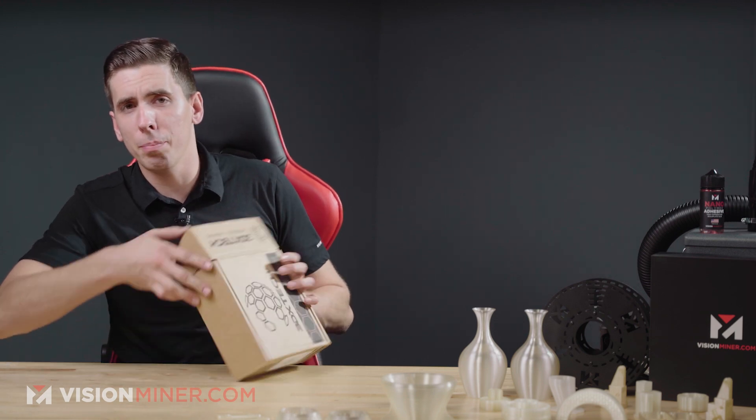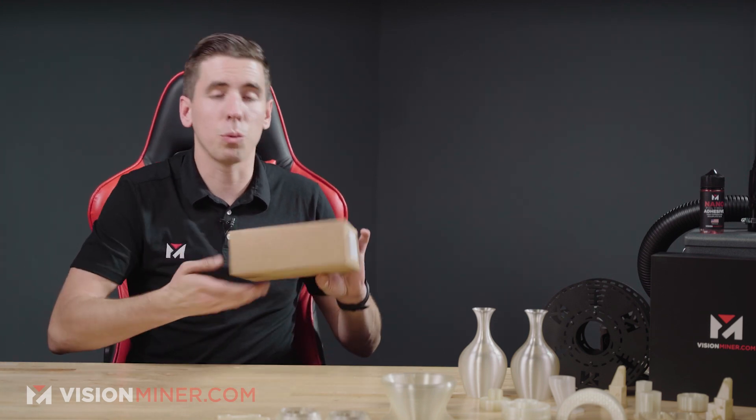Let's talk about where you're going to see this material in actual industries. Firstly, you'll see it in a lot of medical instrument components — manifolds, medical trays, autoclavable instruments. Other industries use it for connectors and coil bodies, high-frequency insulators, lamp sockets, protection caps, and antenna sockets. In automotive, you'll see it used with oil level indicators, valve spools, flanges, tubes, pump cases, and inspection windows — lots of things due to the chemical resistance and high temperature of PSU.